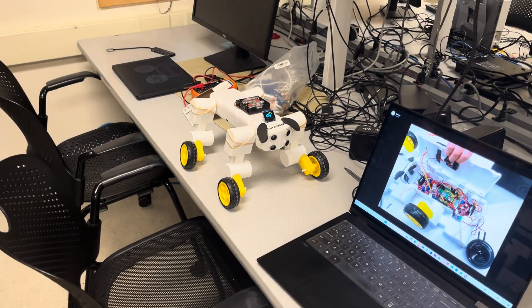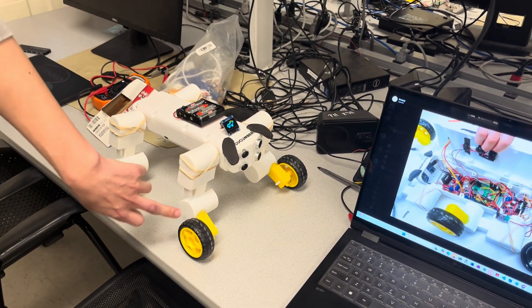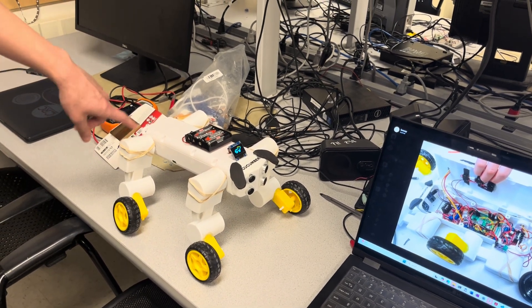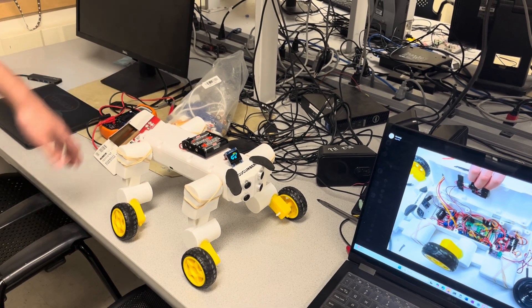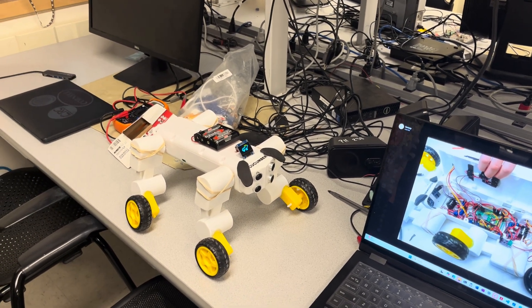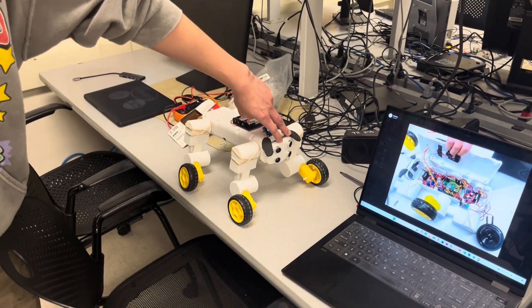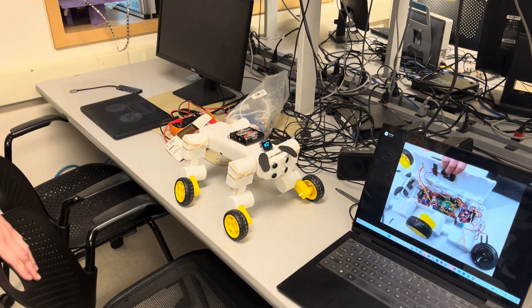We have four DC motors — each one of the wheels is connected to hobby motors hidden inside the kneecaps. On each shoulder joint, we have positional servos, which control the dog and allow it to do poses like paw, sit, and stay. On the outside, its eyes are two ultrasonic sensors, which we use for our following algorithm.